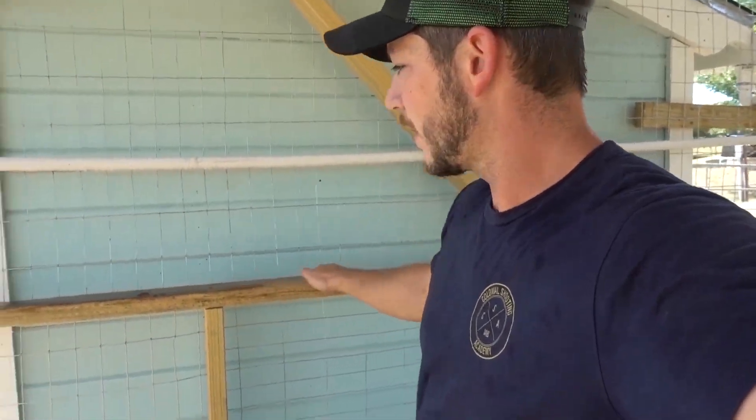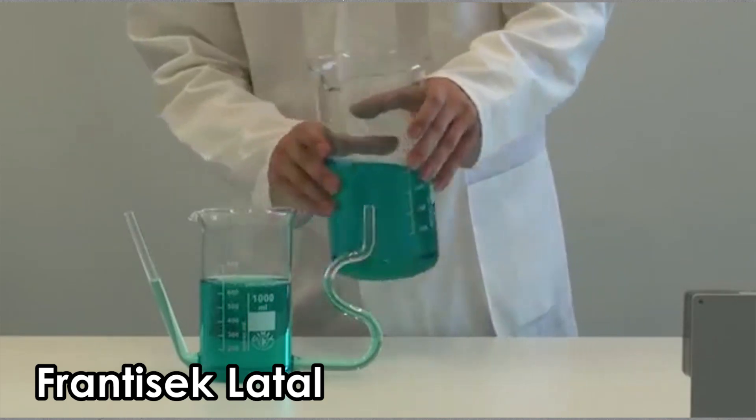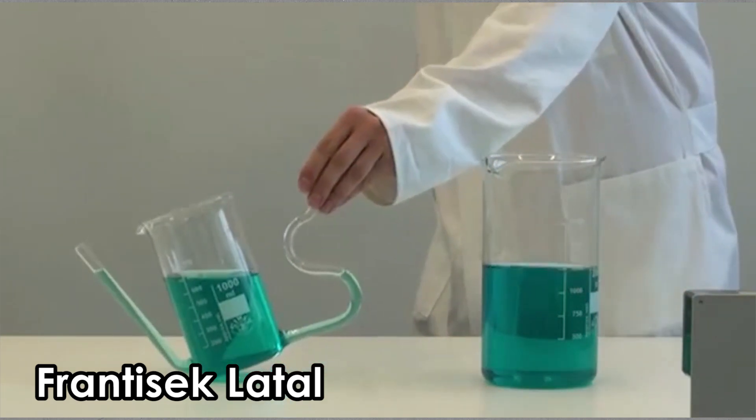What does make sense is the water level being equal in the tank and in the pipe. Matt actually mentioned this in his video — water equilibrates. You can think of it like a watering can: they have a big can, and from the bottom there's a spout, and the water in the spout is always the same level as the water in the can. So if the barrels are halfway full, the water will also be that level in the pipe. If it rains, water comes down, the level in the pipe rises, and it flows down to balance out — communicating vessels. If vessels are communicating, they always hold the same level of water.